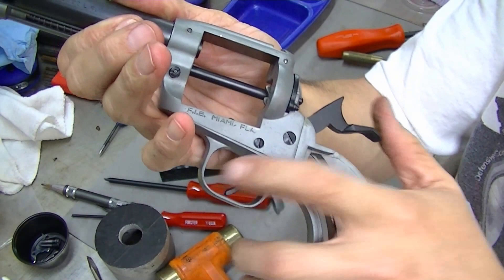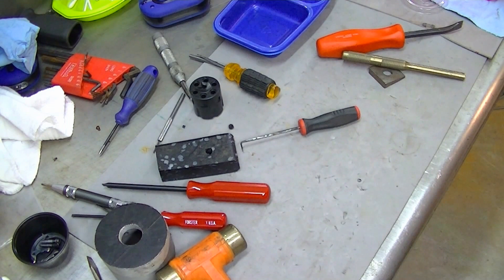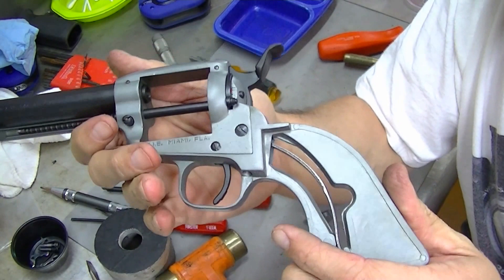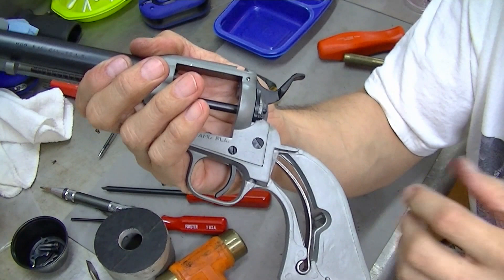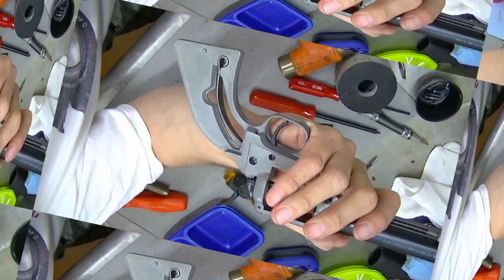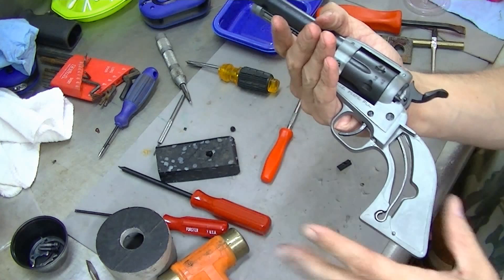I am going to lube this. The gate ended up on the ground — I left the gate off of there. I just wanted to double check and make sure that I had, in fact, solved the problem. I'll go ahead and pull this back off tomorrow, put the gate in, lube everything a little bit with some frog lube. It's already been lubed but I'm going to hit it again just a little bit. Put it all back together and we'll be done with it. It's back together — the issue was this screw right here for the safety selector; it was getting into the hand.